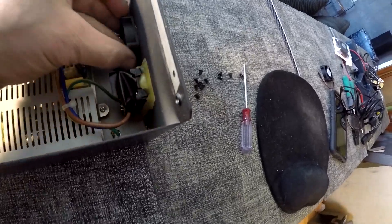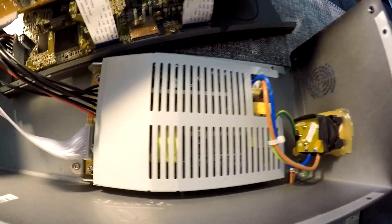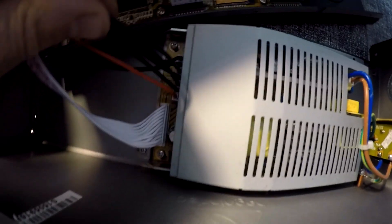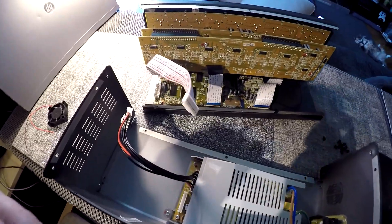You can see the internals of this thing. I'll put the fan and hot glue it right there — it's a perfect fit, it's a 40 millimeter fan. Over here I've got some 5 volt connectors and a ground, so I'll just tag off one of those to the fan — it should work.